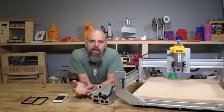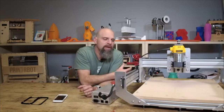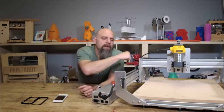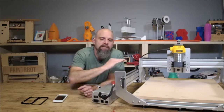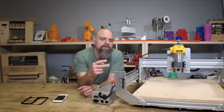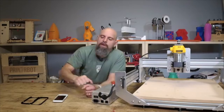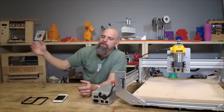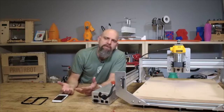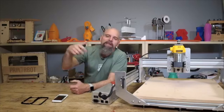You have to have interlocks, which means it has to be fully enclosed, has to be evacuated of air if you're a manufacturer. When you close it, it has to totally turn off the laser with 2 interlocks. In other words, 2 switches that say, I'm closed. No, I'm really closed. And then it won't let you see it. So when I go to my laser cutter, it's FS Laser, which is Chinese, rebadged in Las Vegas. You open it and it turns off the laser.